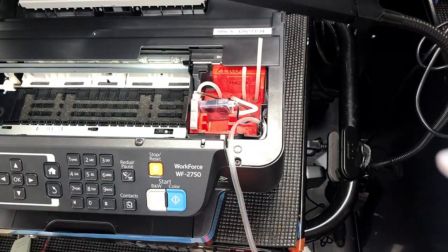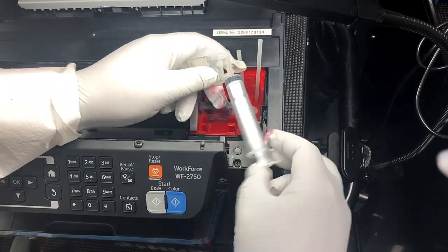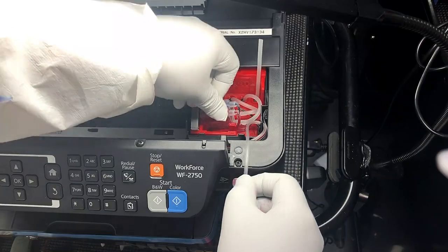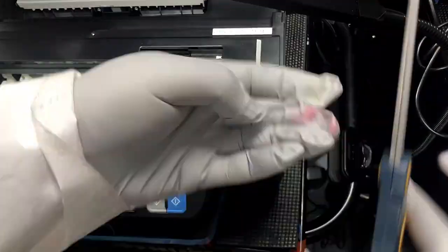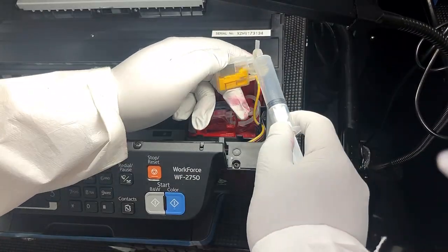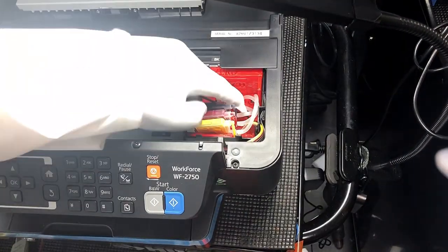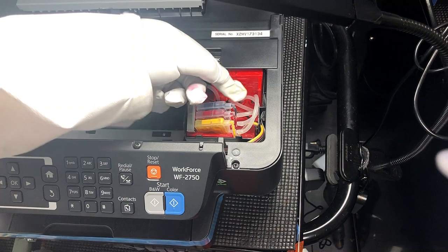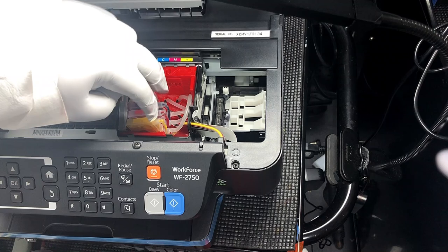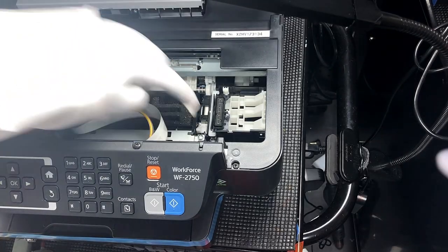The reason I point the smaller tube downwards is that inside the box, if you push the tube down, the tube outside the box is lifted up. So the tube outside will not sag when you're printing — and when it sags, you remember, it gets caught by that piece of metal. For the final check, make sure you don't have any kinks and make sure all the small tubes are pointing down, which lifts the whole tube up so it will not get caught.